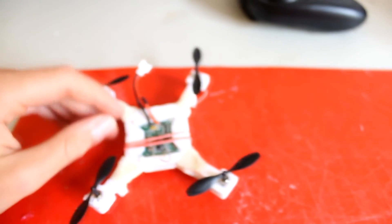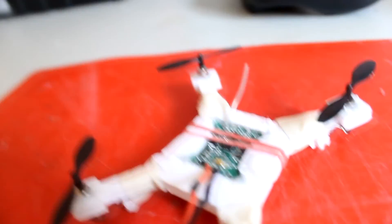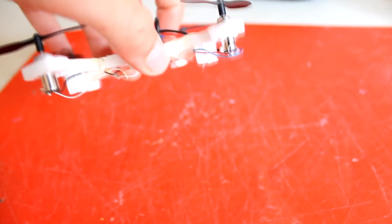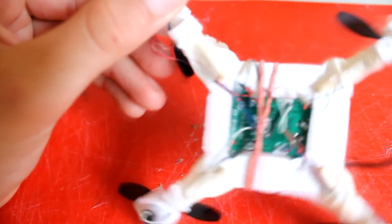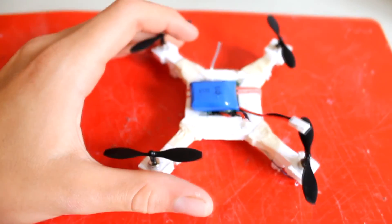Another thing I didn't mention was the battery I'm using - just get this battery, it's just charging down here. I'm using a 200 milliamp, I think it's a 30C discharge, one cell for this, and it's got the typical micro-losi plug. These are 6mm brushed motors. I don't know what the props are - they're just the Bayang Toys X9 ones, and that's the Bayang Toys X9 board. That's all the motor wires. That's your receiver and your plugs, which I had to re-solder because they'd been chopped off. But yeah, that's my basic setup, so I'll take it out for a flight now.